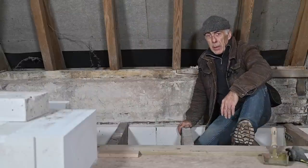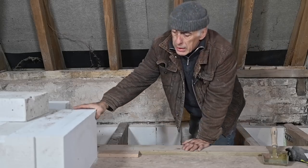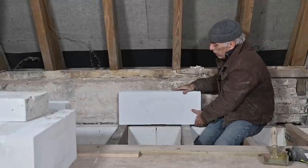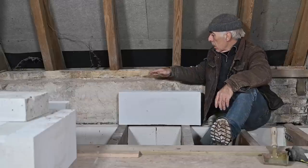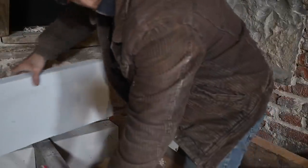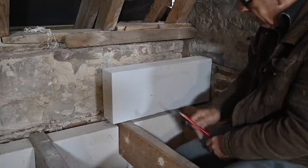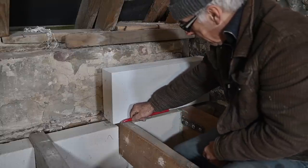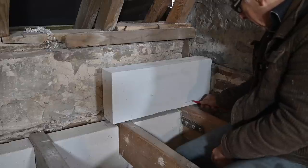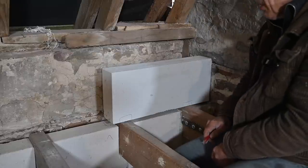The first thing we're going to do in this episode is to erect this cellular concrete wall all the way up to the rafters. We have the cellular concrete blocks right here and we're going to glue them onto the existing blocks and then lock them into the wall with some special plugs, all the way up to the rafters. The first thing will be to cut out some areas where these beams are because they stick out, and then once that is done we can glue them in place. I will do all these blocks in one go first because that makes it easier.